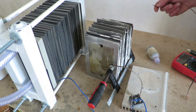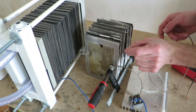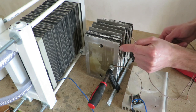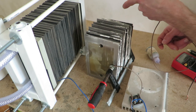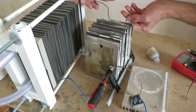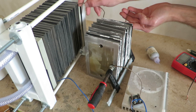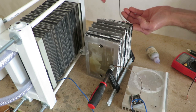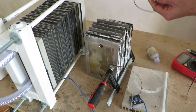As I'm working on 240 volts, I want to maintain a voltage of 2 volts between each plate, so I have 120 plates more or less. So I will connect this side to this side — basically the last cell plates will be connected together so the current may flow from here, through here, and there will be wires. So basically, this is how it's connected.